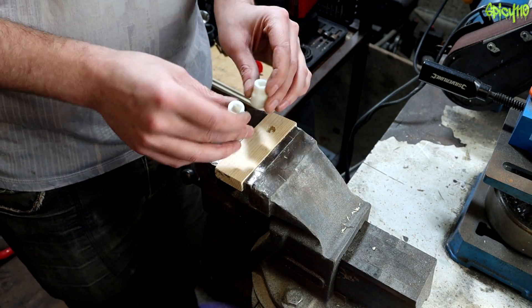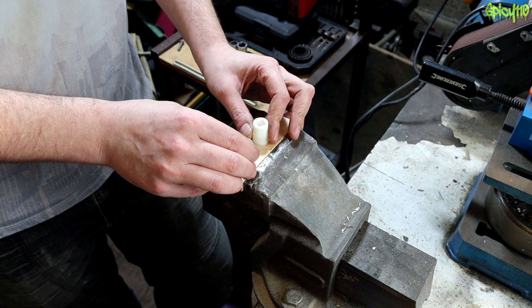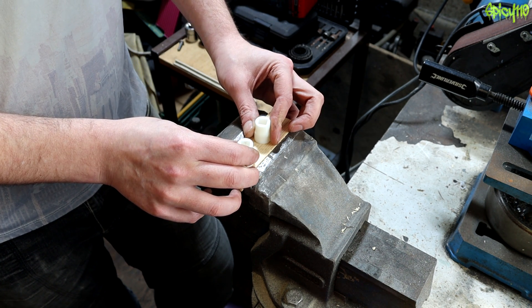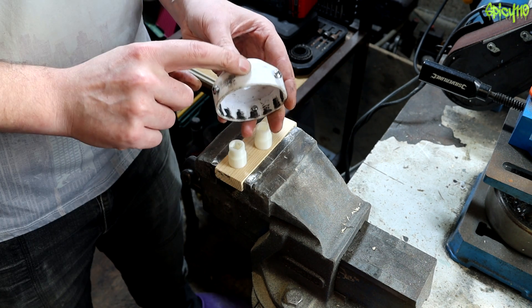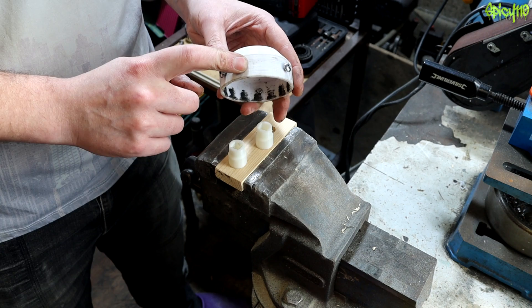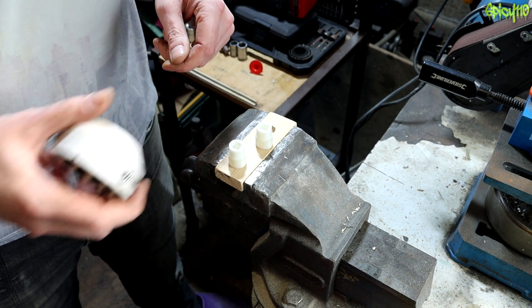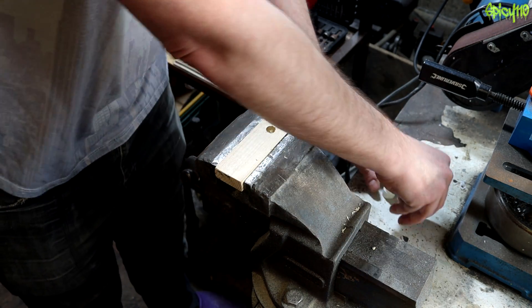For the people that want to know all the specs for the 3D printing: it was printed on an Ender 3 S1 in PLA+. It's 100% infill at a 0.12mm layer height. On this one I did 90% infill, if I remember rightly, and gyroid paths. It's very strong, but yeah — the idea to test this is going to be really simple.